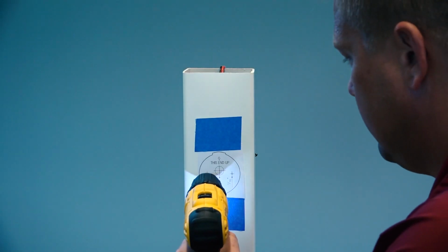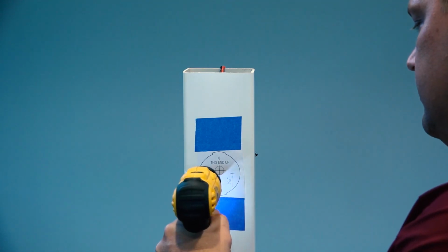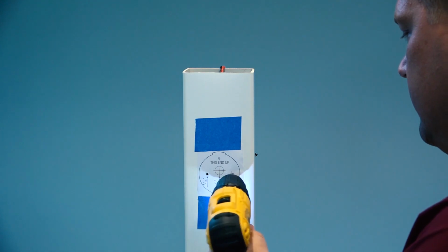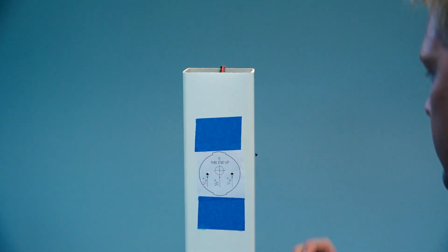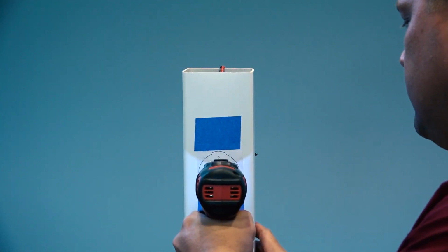To install the LED dome light, cut out the template included in the printed instructions and place it at your desired location. Pre-drill 2 1/16" holes for screws and a 1/2" hole for the wire. Use the installed harness from earlier with the male connector hanging out of the 1/2" hole that you just drilled.